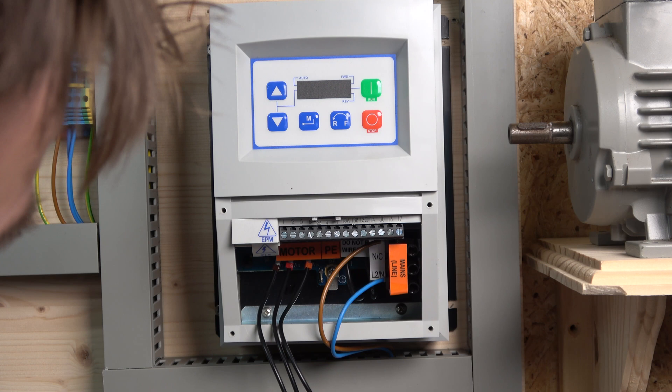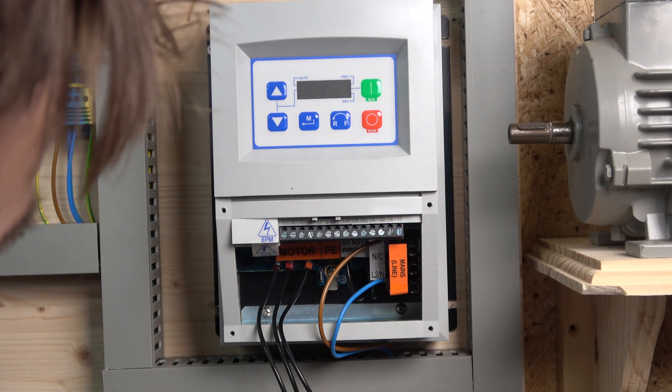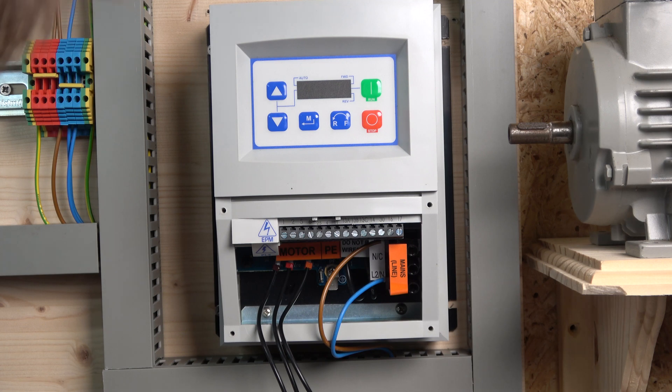Terminal 4 is the digital reference common, and terminal 11 is going to be the supply for your digital inputs — which are terminals 13A, 13B, and 13C. This drive doesn't have a 13D, so we have three digital inputs, which is enough for all the test scenarios we usually cover. Terminal 14 is the digital output, terminal 30 is the analog output, and terminals 16 and 17 are the relay output. Note that this drive does not have TXA and TXB — meaning no RS485 communication.